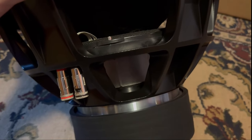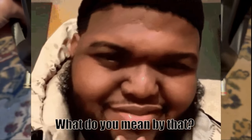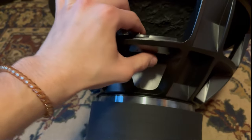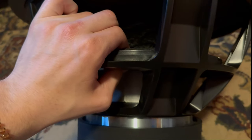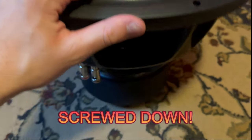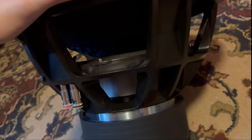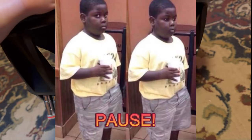There's the 4-inch voice coil going into the motor — that thing is huge, ginormous. And here's the double spider: one pack right there, the other pack right here. I can feel them rub together when I push it down, so it is confirmed double spidered. And guys, this is what I like to see — it is screwed down. I love to see spiders screwed down. That's a big issue with subwoofer manufacturers: they only glue it down. You've got to glue it and screw it for the best spider.